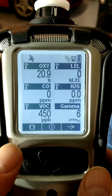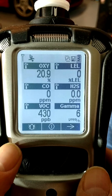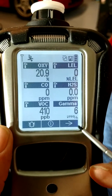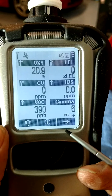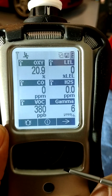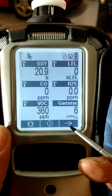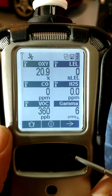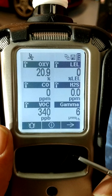The LCD screen will auto-flip if you change its orientation. Note that when you do, the soft keys will change their mapping for the hard keys corresponding to them. For instance, the arrow key, now currently mapped to the N key, will flip over to the Y key when the screen is inverted.